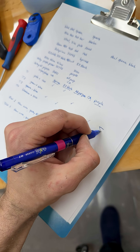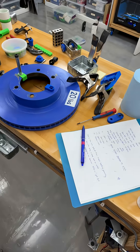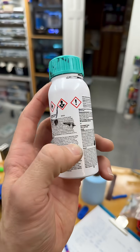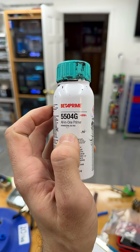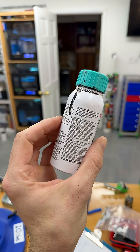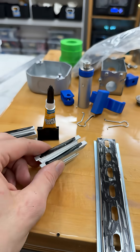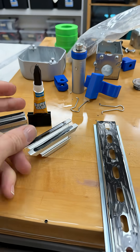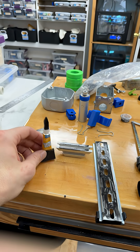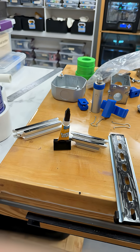That was a nice test. So how do you do it? You need to prime the metal parts — this is what I'm using, but you can't use it because it's for industrial use only. After the metal is primed — and we're going to try steel next — you just apply any CA glue, cyanoacrylate. This is a cheap, whatever brand. Getting something that strong without epoxy is a huge deal.